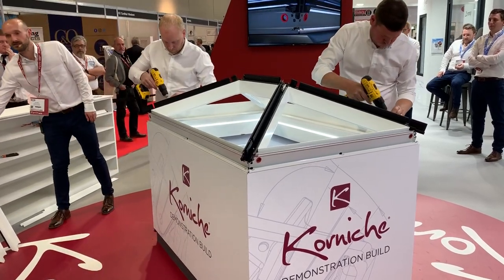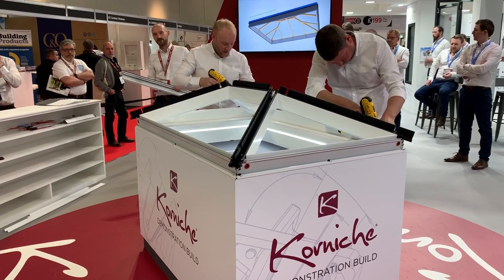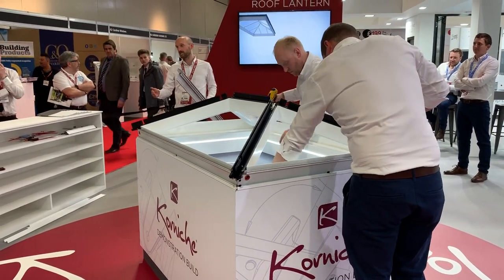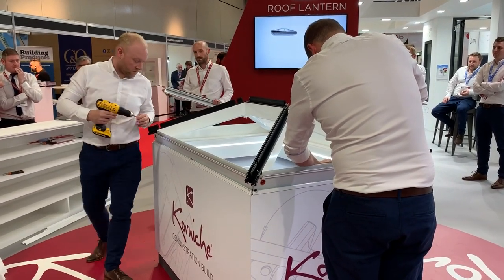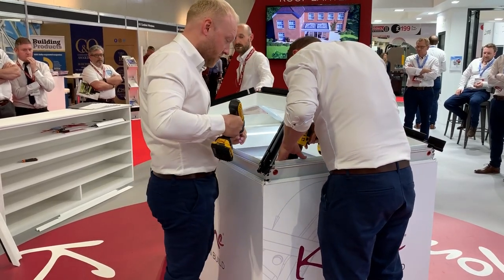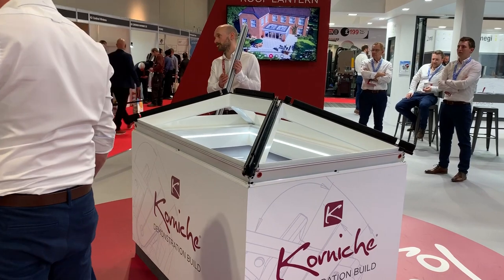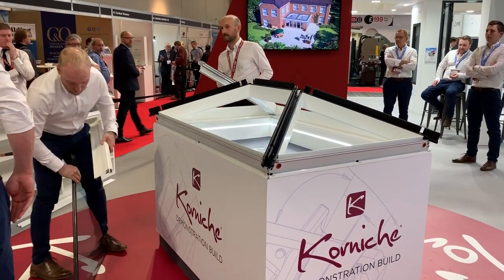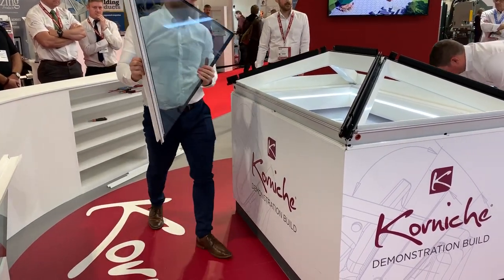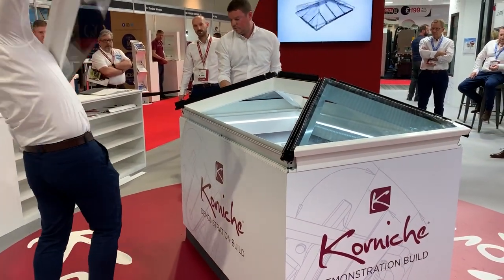While they continue that, here's one of the glazing retainers — one of the big innovations for this roof. The reason we can glaze this in under a minute is the design of the glazing retainer. In a conventional conservatory roof system there's a lot of packing, silicone, glazing tape, and strips to cut, often resulting in an untidy finish. We've incorporated all of those elements into this one part. To glaze our roof, sealing is taken care of by a continuous Q-lon seal running around it with an injection-moulded silicone seal in the middle where the Q-lon meets, forming the glazing closure. The eaves closure and a glass lock are integrated into the profile — two little recesses lock into the edge of the glass so it can't slide down. You simply push the retainers onto the glazed units, get them central, then balance the tips of the glass units on the seals of the roof and rotate the glazing retainers down into position.